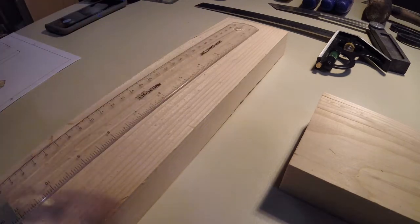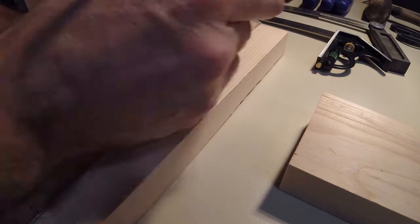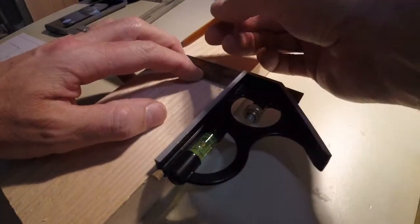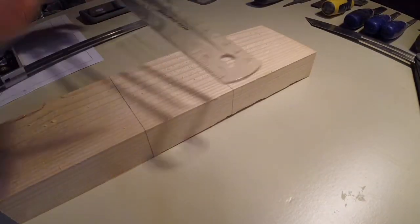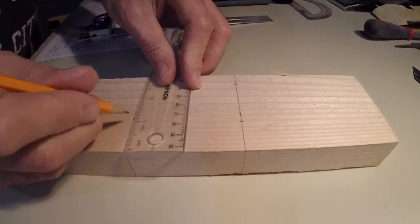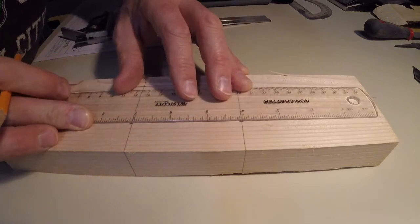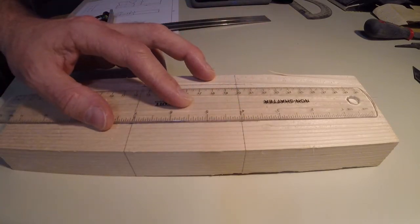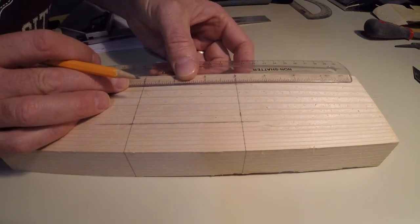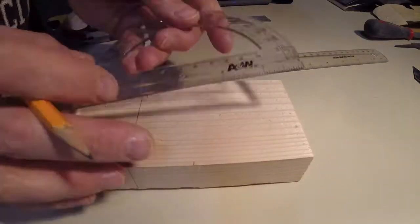So what you're not seeing on screen is the drawing, but you can see my measurements here as I go. Start off on the face for the mortise. Make your marks according to the drawing, and any time you make a mark, go ahead and square it all the way across the board on every edge and every face. We've got two different parts of the joint — the housed part and the dovetail — so we're going to need two different thicknesses. We're at one inch and one and three quarters, and then we're going to square those across. Notice my lines go past the marks, makes kind of a tic-tac-toe shape. So right there we've got three inches wide, and the dovetail part is actually three and a quarter, so I'm going to go an eighth of an inch over on each side. Pay attention, because I'm going to screw this up in just a minute.